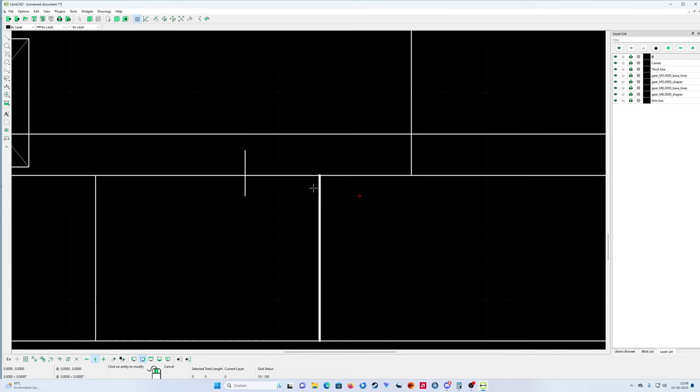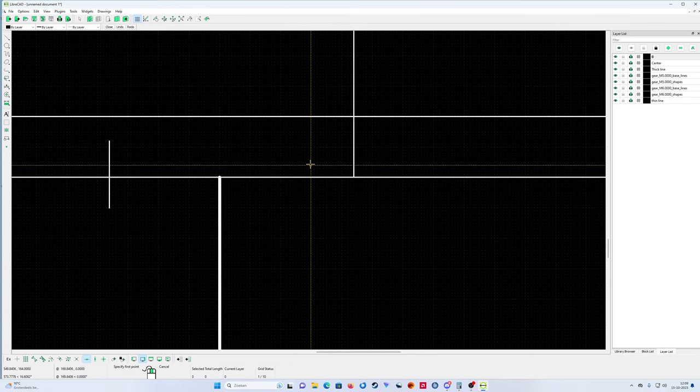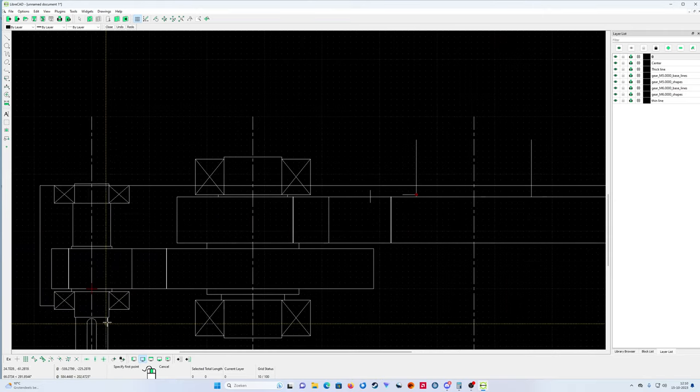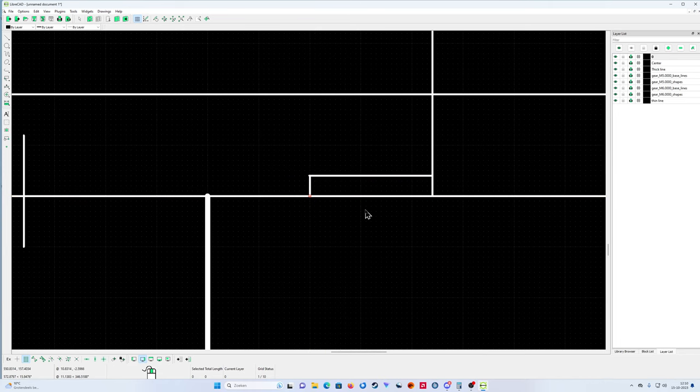Okay, that's the outside diameter of my bearing, and I want to start the bearing at the same height as this one. So I'm going to put this one off. I'm going to snap it on the intersection, like here. I'm going to click it, and restrict it horizontally. Now I'm going to go from here, approximately here. Yeah, from here to here. Because I snapped this point, it's exactly the same measurement. I snap it on the grid again, two points. And that's it.